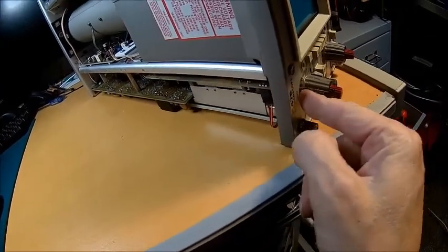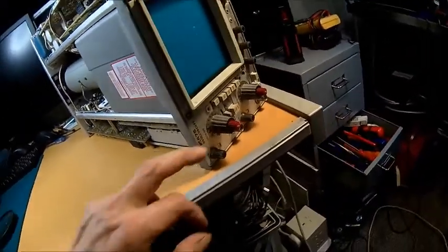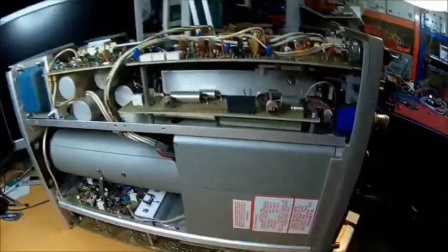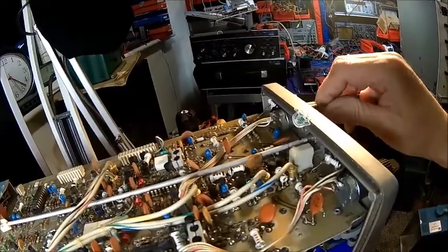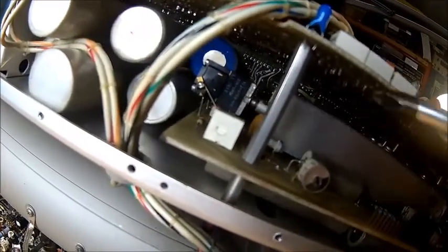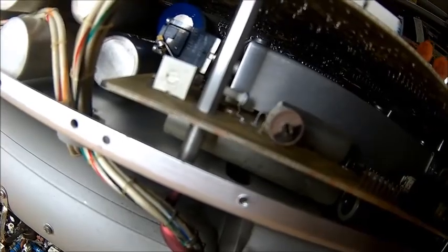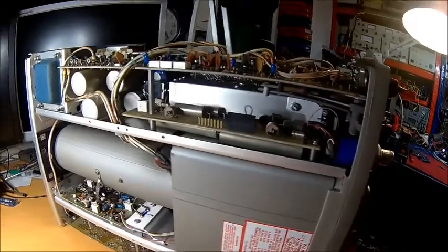I think he glued the original wheels onto the 3D printed knobs. I've seen some of those on eBay — probably worth getting some. I cannot see any significant damage on this side, because these are just two pots — a pot with a switch — so that can be replaced. If you look in here, these two wires seem to be very close together, and if you turn the timebase vernier, it's moving the pot around. So something isn't right here, we may need to separate these wires a little bit.